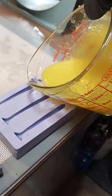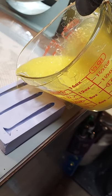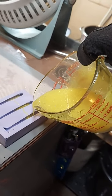I want to keep it around 100 to 150. Silicone will break down at a certain temperature, so I don't want to go too high. So they all get vacuum chambered. And then these little bellies right here — I'm looking at the bait, not the phone, so you guys might get a good angle and you might not.